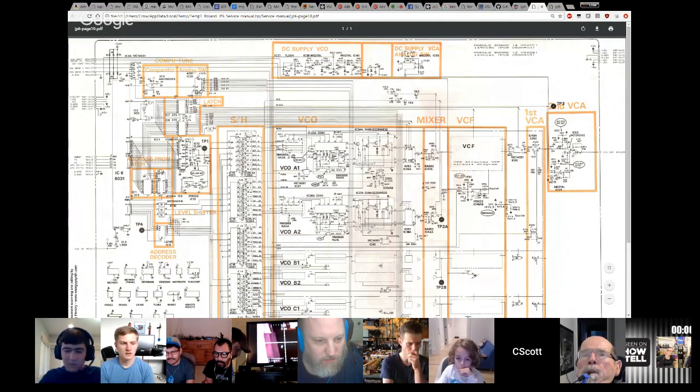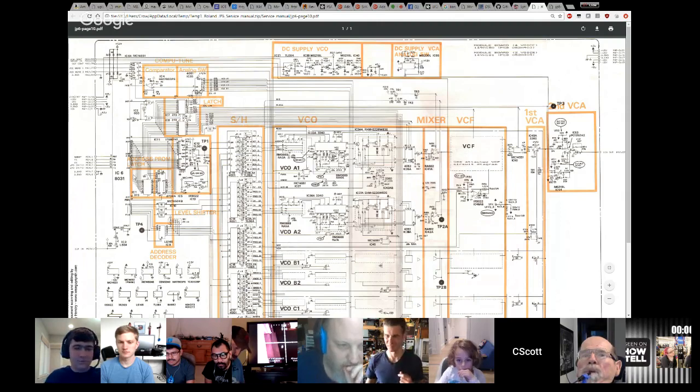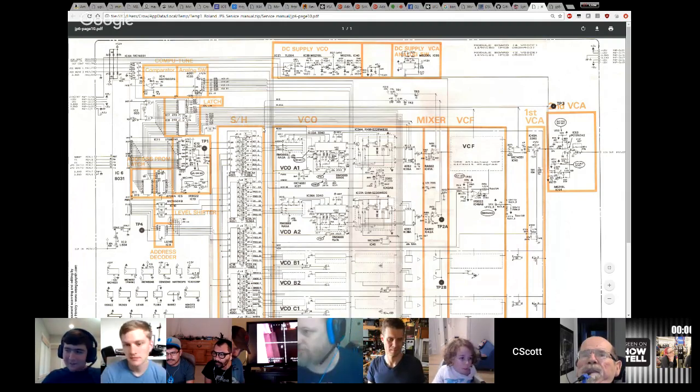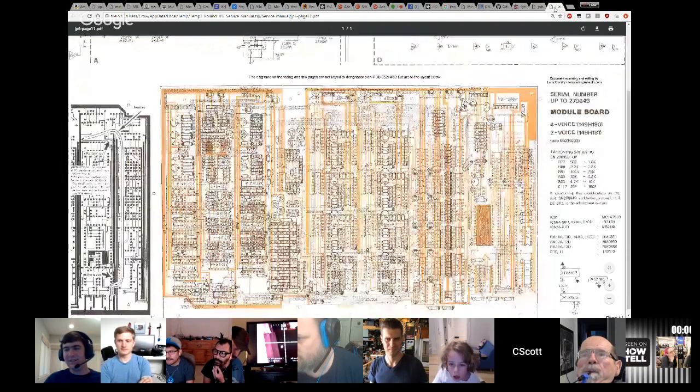This is an Intersil 14-bit DAC. Well, number one, Intersil raises a red flag because they haven't been around for 20 years. And 2, a 14-bit DAC from 1983 is pretty hard to get. So we're just going to use our favorite flavor of a nice 16-bit DAC here that has an SPI interface to connect to. It was using an 8031, but this will be replaced with a CircuitPython Feather. Because there's nothing magical in here, it's receiving codes from a master CPU and then assigning voice parameters and gates and pitch voltages to the rest of the circuit. Now, the whole reason we're doing this is this little block here. It says VCFC attached VCF circuit diagram. Well, that's over here.